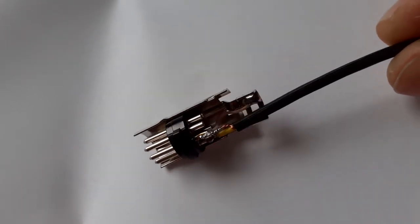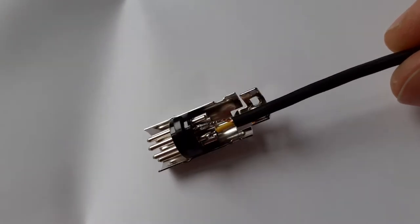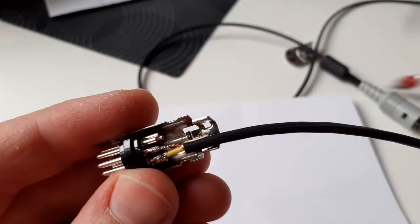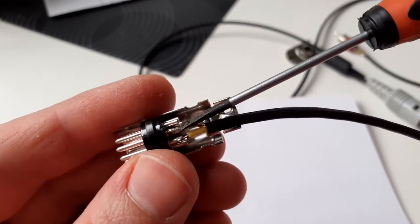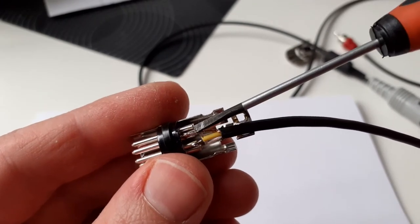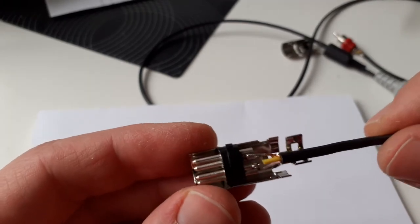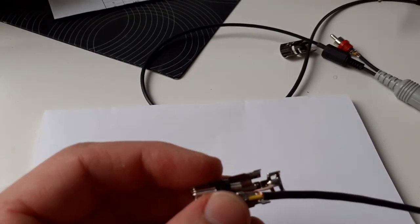Please notice also the connection from pin number 2, which is the top pin, to the housing of the connector. This white wire. Let me, this one here. From here, see. Again, this is required because this common connector of the TS-590 is not connected to ground, and the SDR switch expects to be connected to the ground of the transceiver if it's to operate. And when disconnected, it will actually disable and remain in transmit mode, the SDR switch.